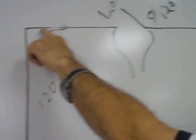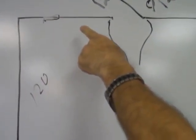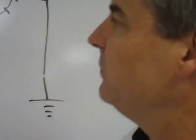So I would want to map this. I would put one lead here in front of this and read across it. Then I'd go to the other side. I'd leave the common port on my neutral side, on my ground. Then I'd come here, here. You always have to have a good source of ground if you're going to troubleshoot electrical systems.